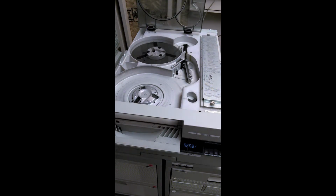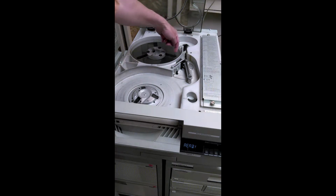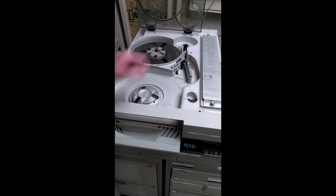So this particular drive here, there's no way for an operator, or there is a way, but the normal operating procedure was for the tape to just be inserted and then the drive to automatically thread the tape, to minimize the amount of manual handling that an operator had to do on the tape, because again, stretching the tape or contaminating the tape was very bad and could lead to a lot of data errors. So a tape would go in through the drawer, and then this airstream would blow the tape around the tape path, and then it would get threaded on the take-up reel here, and there's a tensioning arm that can be used to vary the amount of tension that's on the tape and so forth.